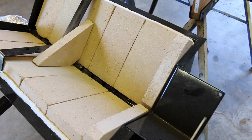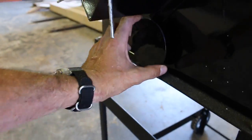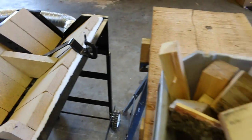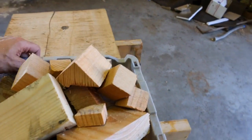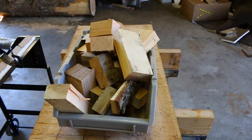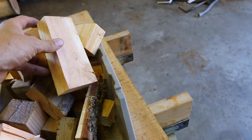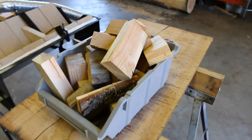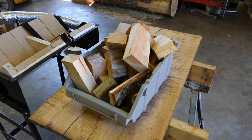So what do we have here? We've got the divider in the center — we'll use half the forge, just a medium fire. We'll turn our dial down here to about five, which will open up the air vents on this side. I went on the Whitlock's website and they said a softwood like fir works really well, with an ideal dimension of about two inches by six inches. I've just got loose remnants and cutoffs from projects — two-by-fours and such — some have bark, some don't, but they all have one thing in common: they're very dry.